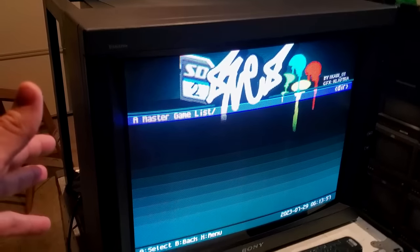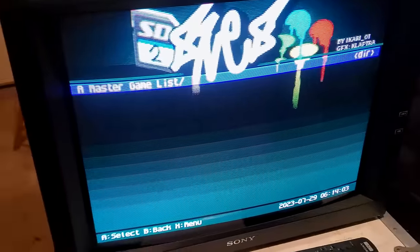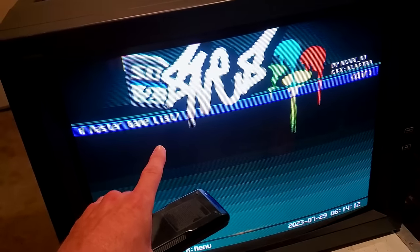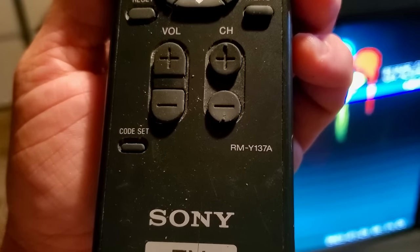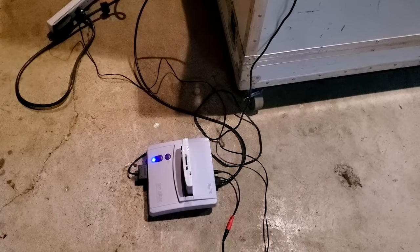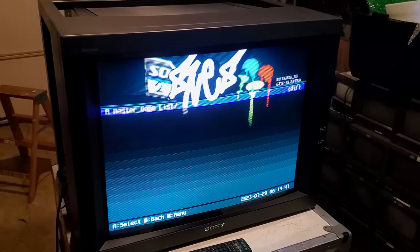The monitor's got its final set of adjustments. I'm not going to go over the adjustments today because I've done that in a past video which I'll link in the description, but you will need some type of remote. There is a standard remote for this CRT — this one is RM-Y137A — and you can use almost any generic remote from a TV of that era. We're going to pull up the 240p test suite using RGB through a modified Super Nintendo that has Voultar's RGB kit in it, run into the monitor.